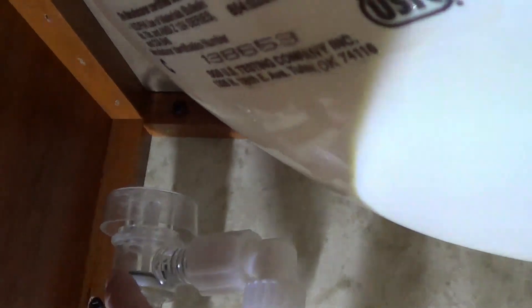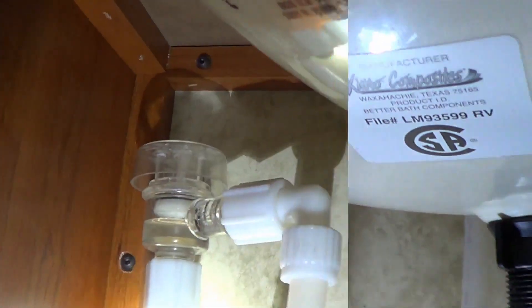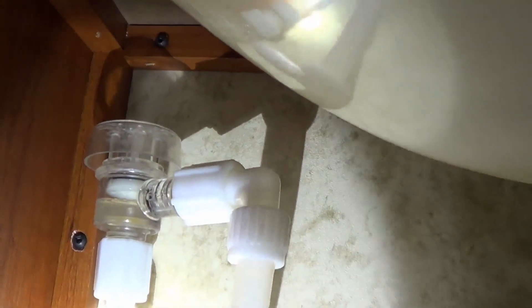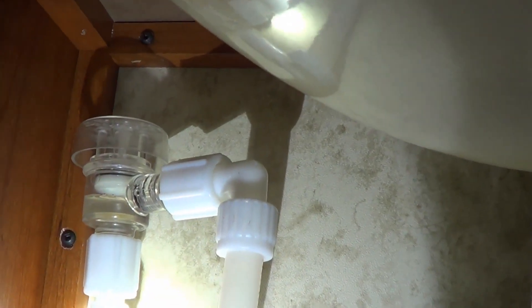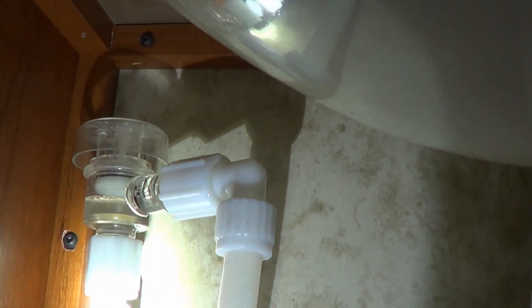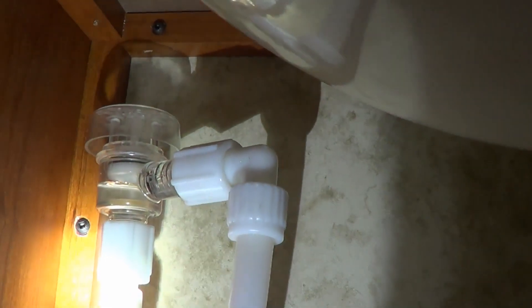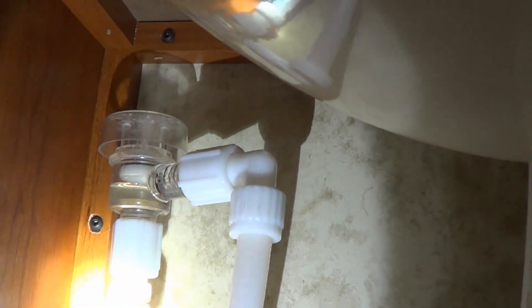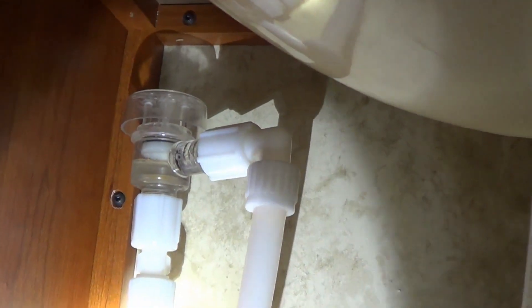You can see there's sort of a plunger up there. I'm going to go turn on the water and see if we get water up into that valve or not. Okay, we definitely have water up into that thing. So that means the path is clear up to the check valve. I'm just going to drain the water and pull that check valve so I can see if it's faulty or not. It only hand-tightens on that PEX tubing, so it's pretty easy to get apart.